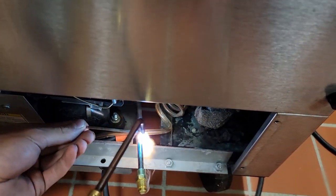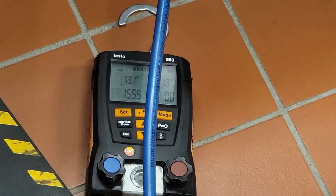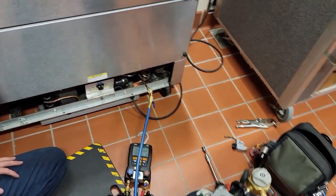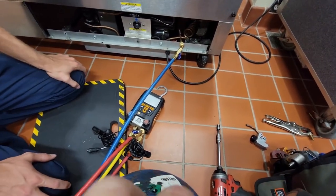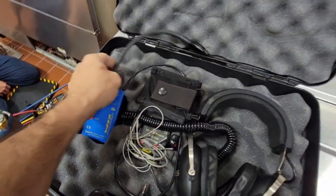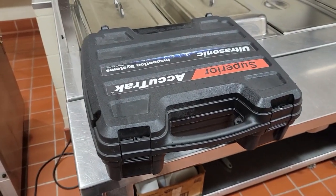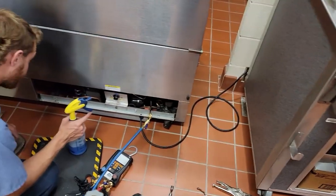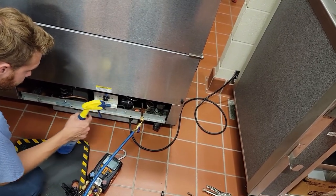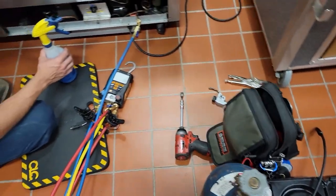Don't melt that plastic. We've got 155 PSI into that thing. If we would have done it on the high side we could use the pressure test timer built into the gauges, but let's see if we can hear anything - it's probably in a side wall so I may not be able to find much. We can't use the ultrasonic in here because there's got to be some rodent activity because it's squealing no matter where I go. But when I go out into the control room where the chiller's at, it goes away. It's got 155 pounds on it and it's holding.